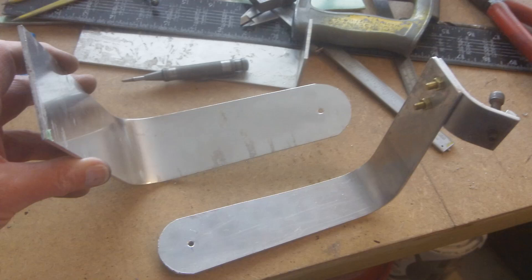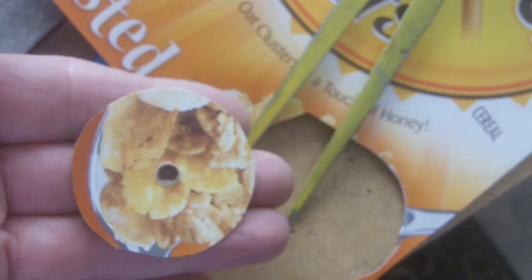I'm starting to shape the ends of the arms. I cut two large washers out of a cornflake packet to fit between the arms, and I bolt them together using a lock nut. I arrange it so that the bolts are not tight, because if the arms are fixed together too tight you get a juddering action rather than a smooth swivel action.